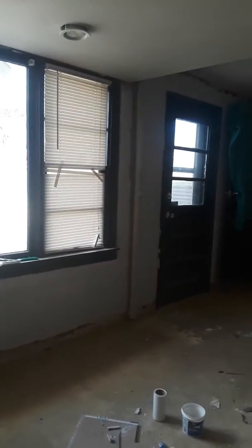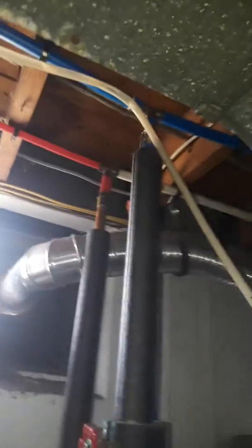We have a walkout basement. For a 90% furnace, we can go out through the block — it's a brick home, so we can go out through the brick and block anywhere around here. The chimney is probably over there, so we'd likely go out right over the top of one of those window openings. It's only going to be two-inch PVC.